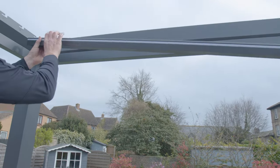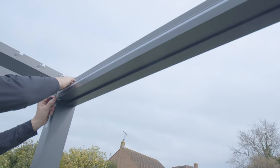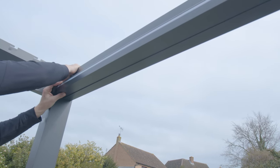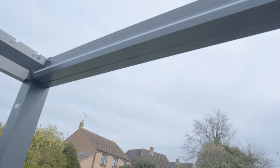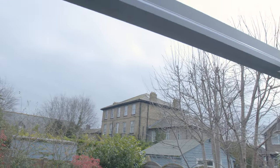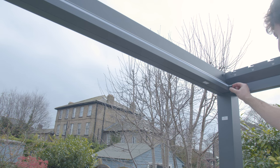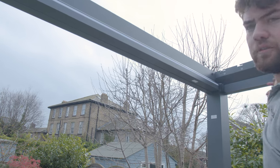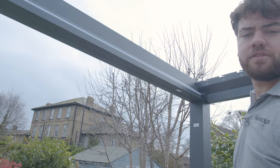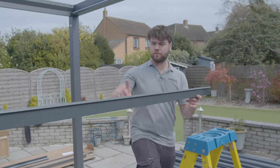Pass that in to Wayne — all you do is butt them up to the rubber inserts at each end and just make sure that it's slotted in all the way along. You'll see at the ends here they just butt up nicely to the rubber inserts. This bit will hook over the top, but we'll wait until we've got all four gutters in place before we hook those over. Now doing the same again for the four metre side — it goes up in the exact same way, just making sure that it butts up to the rubber on each end.